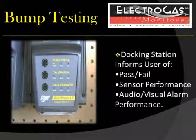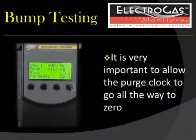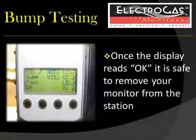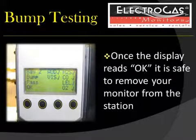The docking station will show you whether your monitor passes or fails, while the display shows sensor performance and audio-visual alarm performance. After the process is complete, it is very important to allow the purge clock to reach 0. Once the purge cycle is complete, the docking station will read OK, and it is now safe to remove your monitor.